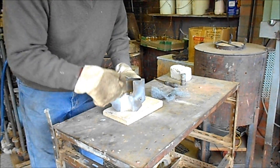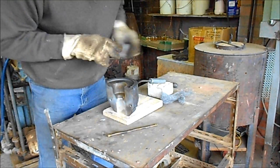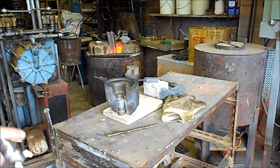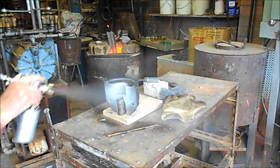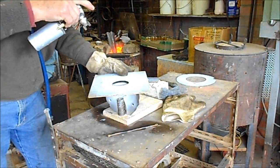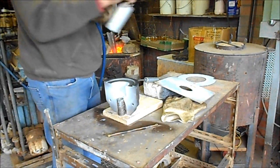I'm going to put it in and brush the soot from the flame and make the coating. It's just a bit of a normal cut-down paint spray gun. The coating is water-based and flashes dry as soon as it hits the die. I only want it where the metal is actually going to contact the die — I don't want it on areas where it needs to slide on the other side.